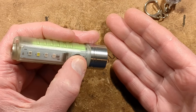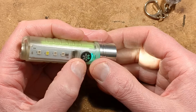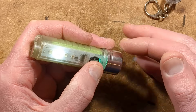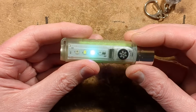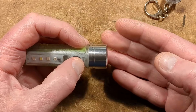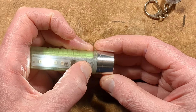If you press the button once it goes to full intensity. Press it again — notice the green power level LED. Press it again and it goes to low intensity; that is so flickery — it's static to the human eye but not on camera. Press it again and it goes into strobe mode. Then it goes on to the white LED, then the completely useless 'I am a police car' type thing, and then it lights an ultraviolet-ish LED. Because the case has what looks like strontium aluminate in it, it makes it fluoresce, which kind of defeats the point of the ultraviolet but it's an interesting effect. When you click the button it goes off. If you leave it — say on the low setting — for about 10 seconds and then click, it will just go straight off. Alternatively, if you're clicking through modes and you just press and hold continuously, it will also go off.